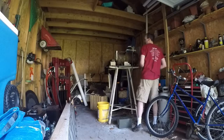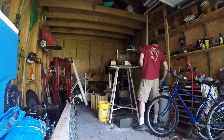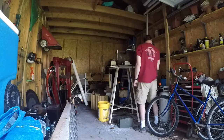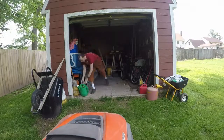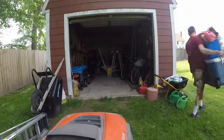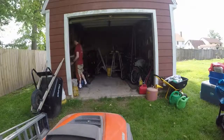Here's time to light the forge. This is a homemade forge made out of a propane tank from a forklift — it's the same diameter as a 20-pounder but a little bit longer. That allows me to get a couple more inches of heat zone up to welding temperature, which is important when working on billets like this because you want to get everything up to an even temperature. The burners are two Black Beauty burners you can get online, and they work really well. My shed doubles as a storage shed and a forge, so I have to pull everything out every time I use it.